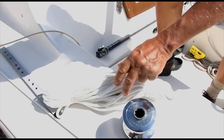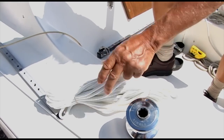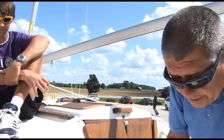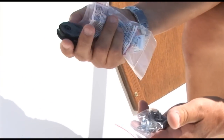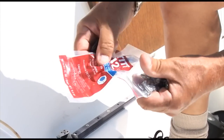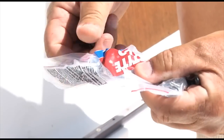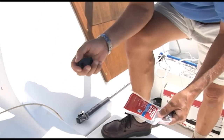This is the line that will be used to cradle the sail — the lower part of the sail. It will go underneath the boom in two strands and up to the jack lines we just installed on the mast. This is the turning block that will be mounted on one side, the cleat, and then the hardware — that all comes as part of the kit. The Loctite is especially important if you're not using rivets; if you're using screws you'd want to use the Loctite that comes with the kit.